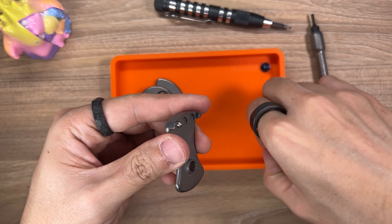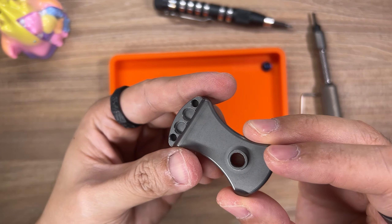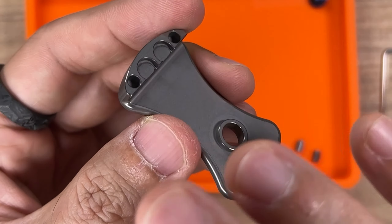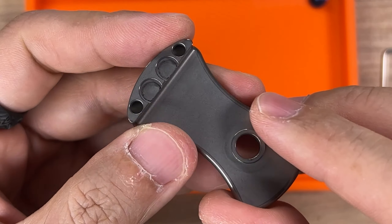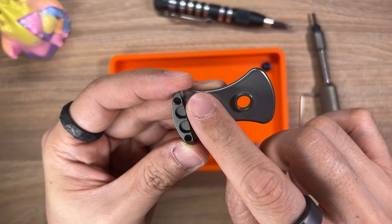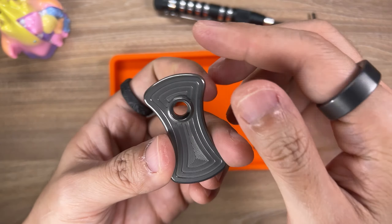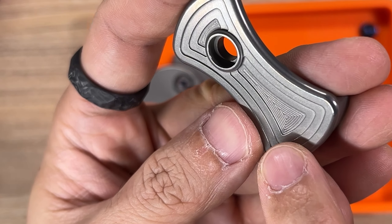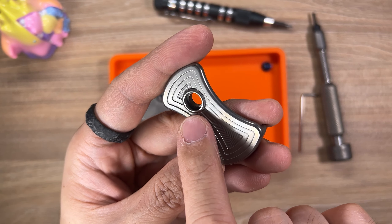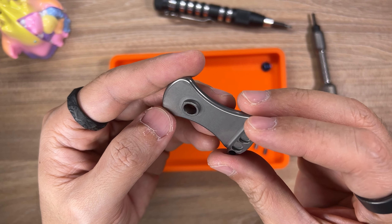So now I'll put that one screw aside and lift up to separate the two halves apart. You'll see there are a couple of other pins here — these are the alignment pins. I believe these pins are custom made because one side is flat but one side is nicely stepped, which leads me to think they've been custom machined. They sit in these two respective slots on the outside, and the inner slots are of course for the magnets. I'm going to remove these because I want to talk about each half of the main clamp area. These are amazingly finished — look at the machining work. Every single edge is nicely rounded and chamfered. Even the sharp edges are nicely deburred. You're not going to find a single sharp corner or any sharp surfaces that will bite you.